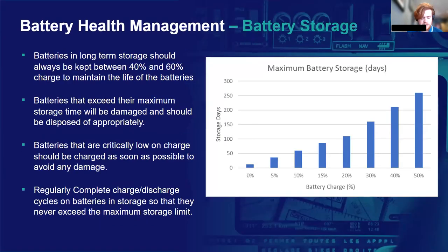Battery storage. For storage, you only want to keep batteries between 40 and 60% charge. This graph shows how long a battery will last in storage before it's irreversibly damaged. The lifespan is maximized at 50%, where the battery should last approximately 250 days — although it isn't recommended to leave it untouched for more than 90 days. If after a flight your battery is under 40%, I strongly suggest charging it to 50%, because there's a serious drop off in how long these batteries will last below that point. If they go beyond that point they're irreversibly damaged. Charge-discharge cycles are a good way to ensure batteries don't reach this maximum storage limit.